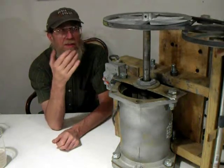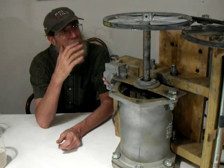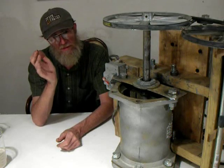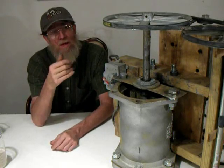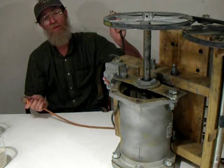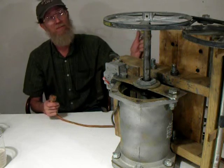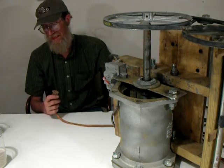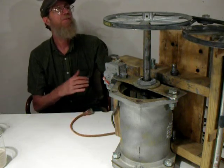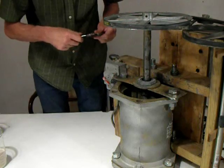It's really quite powerful. Now obviously with an open belt system, if you've got anybody working in a shop around here or you have children, this would not be safe. When you store it, I recommend taking the belts off — that way a kid can't turn it on. Also, when you get ready to pull the impeller out, it's always a good idea to simply unplug it even though it is turned off. That way nothing can go wrong. With this much reduction on this powerful engine, this thing could definitely do some damage if you accidentally turn it on. If you do have a situation with a lot of people, you need to make a welded wire shield that covers the open belt.